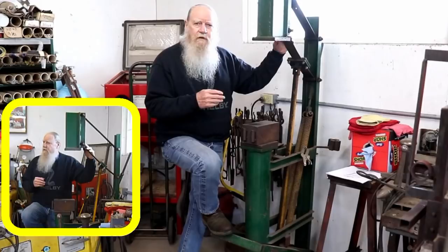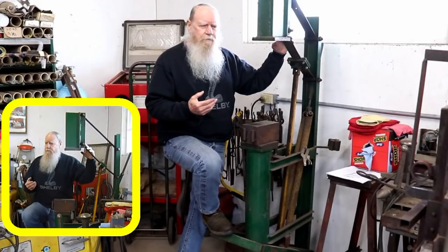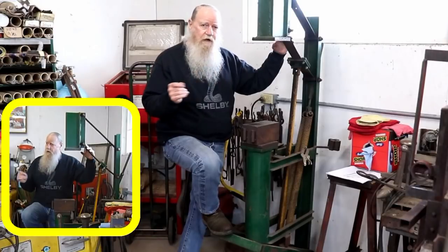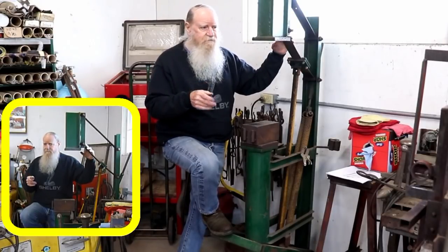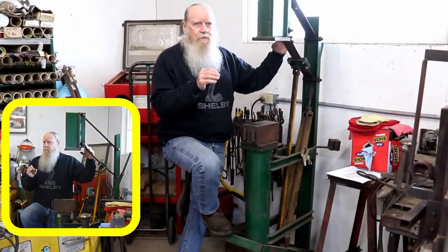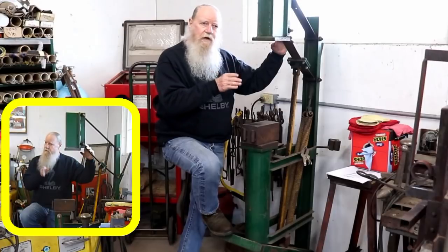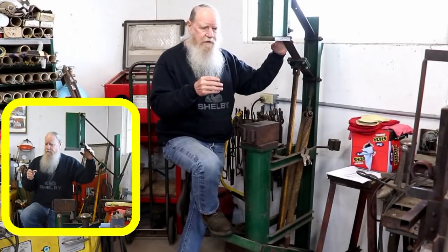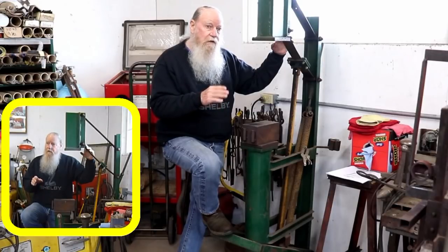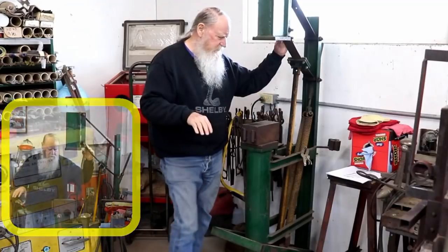The way I did these was I made the first pass with a MIG, and you could also use 6011 or 5P. 5P is good. And then I put a wash pass over that with 7018 with a stick, and that allowed the different materials to become a little bit more homogeneous and didn't create a fracture line behind the weld on the spring. So by bringing the heat up, I hate to use the word annealed, but it didn't leave a sharp line from the hot to the cold. Read about that stuff.